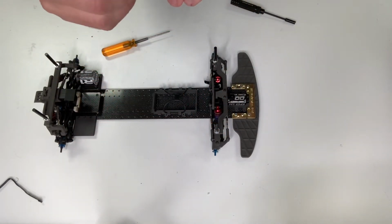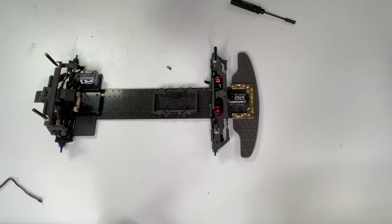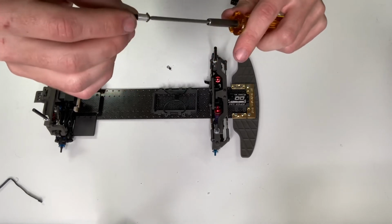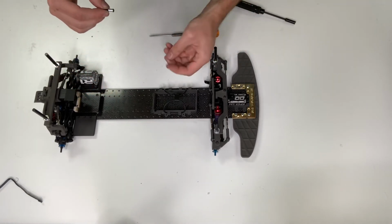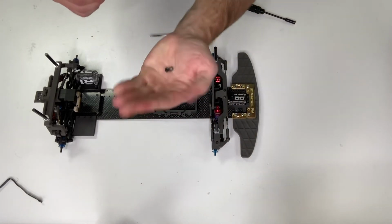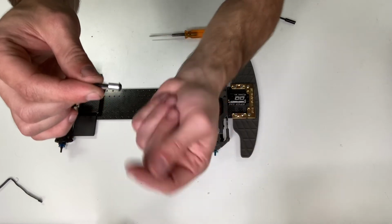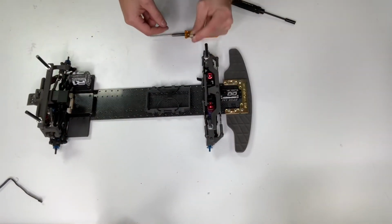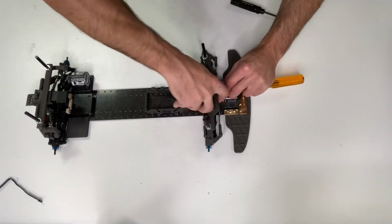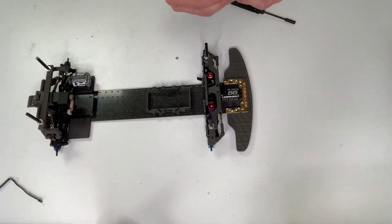If you use both those bushings together, it'll work the same. So, easiest way to do it is take off the washer or the nut and the rear washer, leaving the screw, one washer, and the bushing to go in from the front side through the centering bracket and then through the tower.